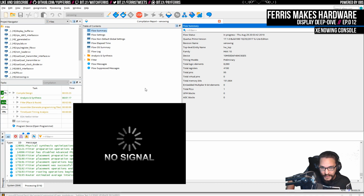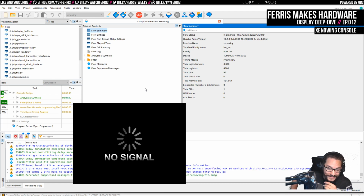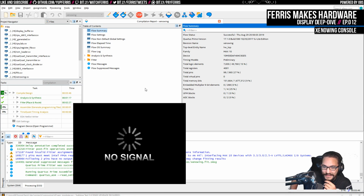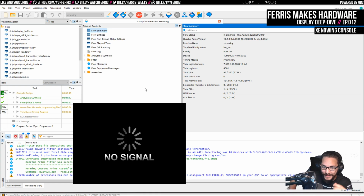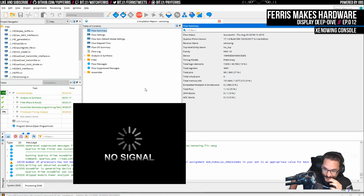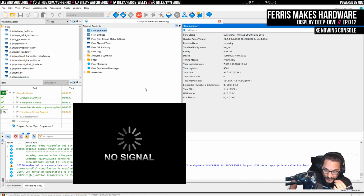So if you get this stuff wrong, you're violating timings in the DRAM, and I don't think that you could damage it in the case of these chips. There's probably not issues with that, but the issue is that you'd get random bits being wrong if you didn't refresh, or bad state transitions. I don't know what would happen. So it's one of those things where I feel like I could do it, but for a free time project, it's a bad use of my time, because I would have to be so thorough.